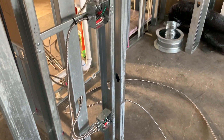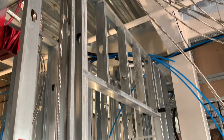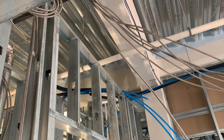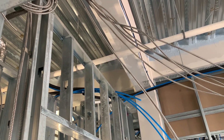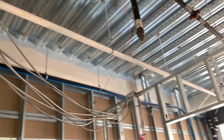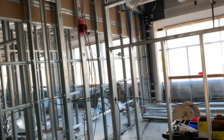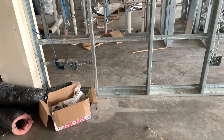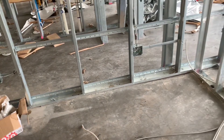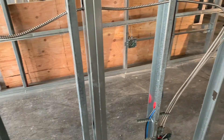Here is the bedroom with the switch box for the light in the center of the room with the coil right there. And then these are the home runs that I didn't get to finish because I just got the straps for those. But the plumber ran his pipe right over the top of my wires, so I'm going to have to pull all that wire back over that wall and go over the plumber's pipe because he kind of screwed me. And then I'm just making up the bedroom plugs — pretty basic stuff, just power in, power out from the home run box.